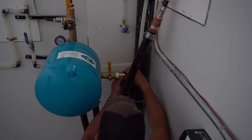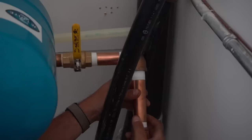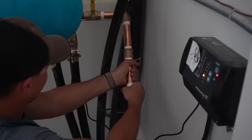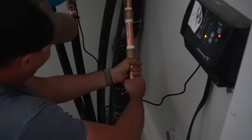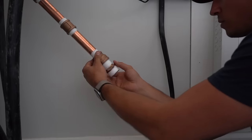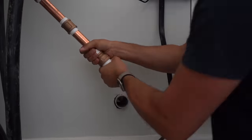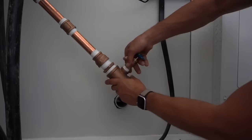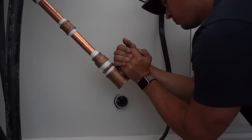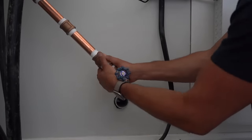I'm not a plumber by trade but I've dabbled in it enough to know my way around fittings. The problem was I needed to upsize from the one-inch feed from the well line into an inch-and-a-half fitting so I could use the inch-and-a-half poly pipe I had bought, and at the same time I had to go from brass fittings into plastic. The right fittings weren't easy to come by — even the local plumbing distributor didn't have much of what I needed. I also added a valve with a hose bib so I can easily hook up my air compressor in the fall to blow out the irrigation lines from inside the building.